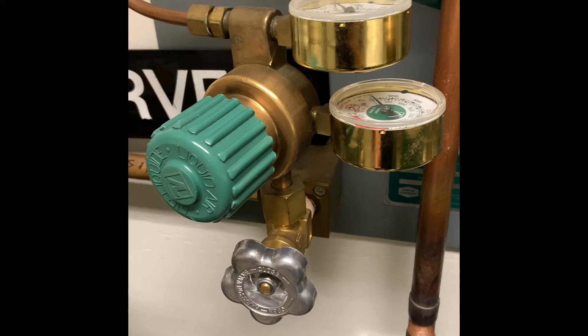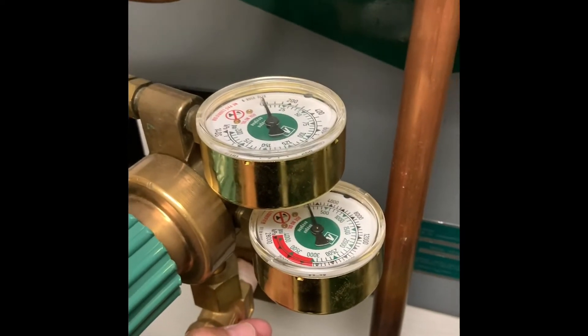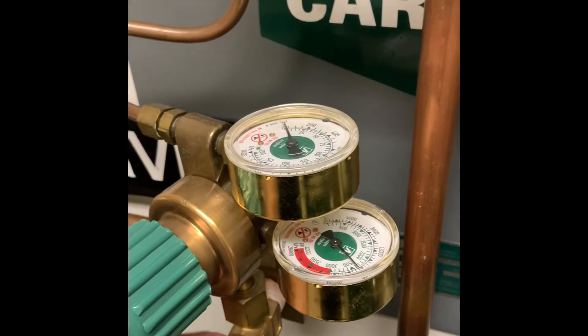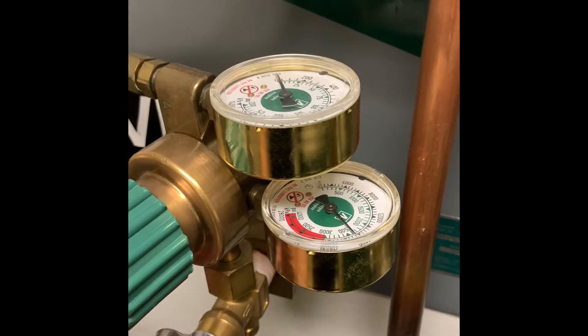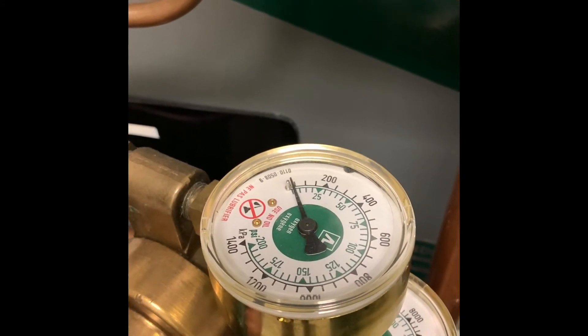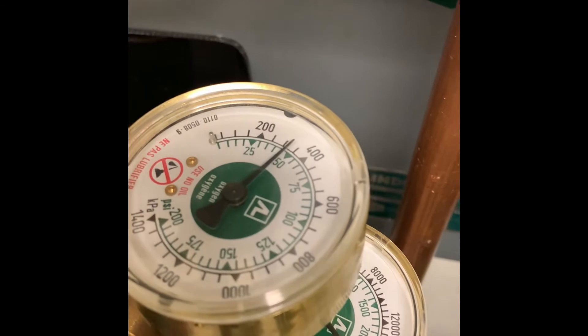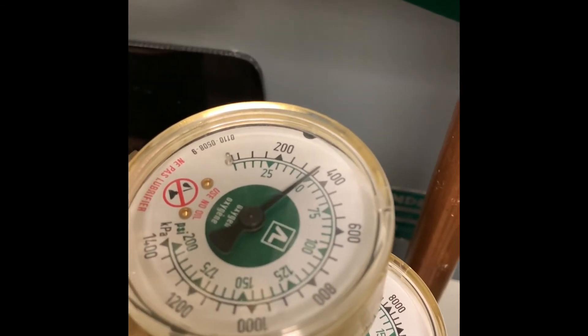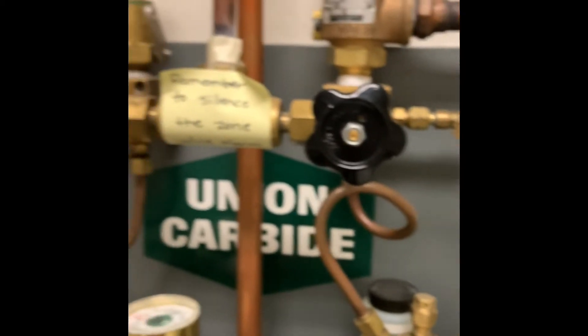At this point I will have opened the cylinders on the reserve side as well, and now I will need to adjust the reserve pressure-reducing valve to a pressure of 50 psig. So now we have the service side PRV set at 55 psig and the reserve side PRV set at 50 psig.